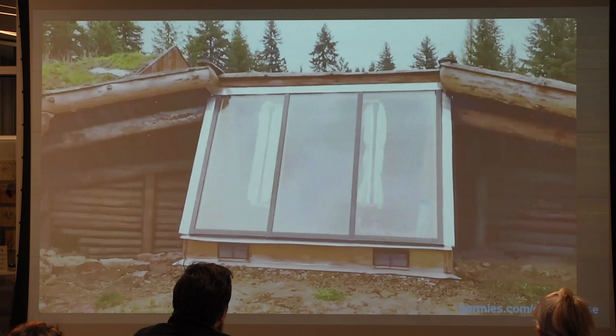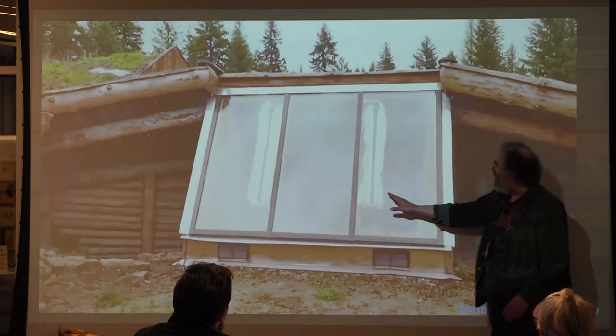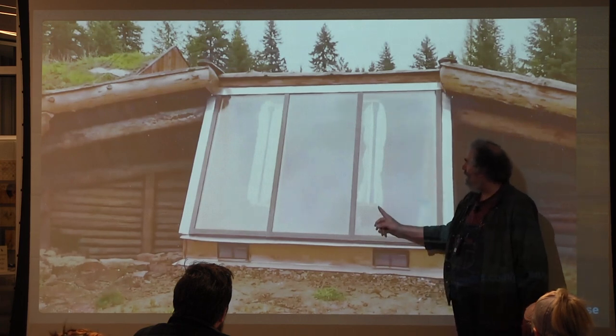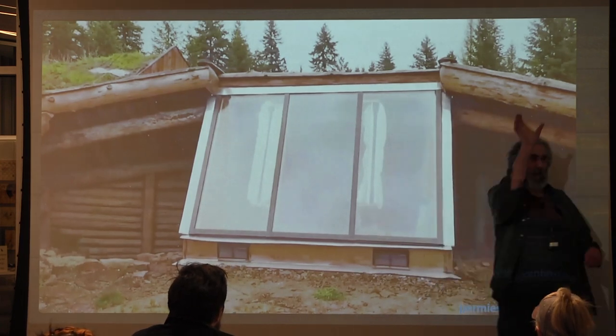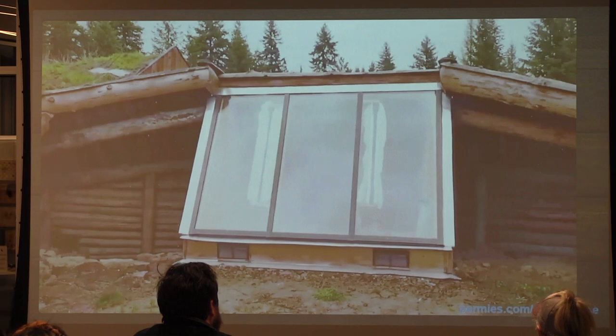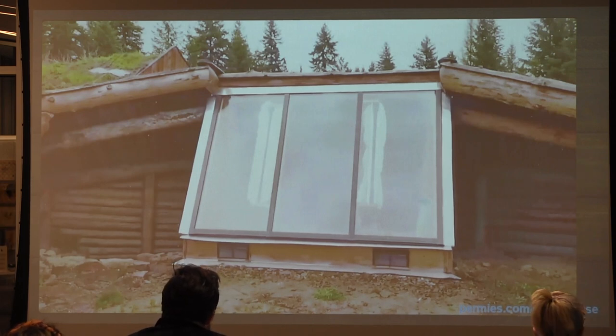Here you can kind of see the destratification pipes. We ended up putting a little bit of insulation behind each one. And behind each pipe, there's also a reflective half tube. It's just a cardboard tube with some foil on it. So probably not as high tech as the reflective stuff that was being mentioned earlier, but it did make a difference. Once we started implementing each of these steps, we saw a big leap in the temperatures at the bottom of those thermal wells.